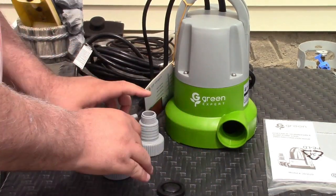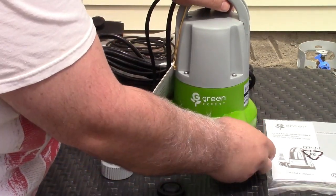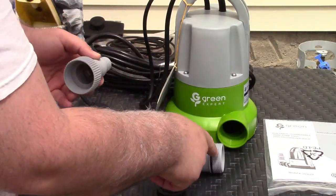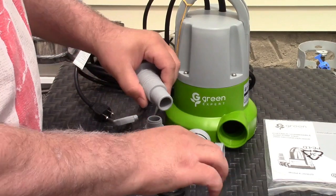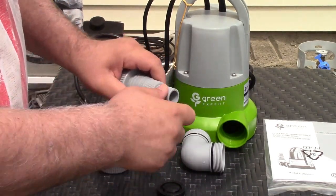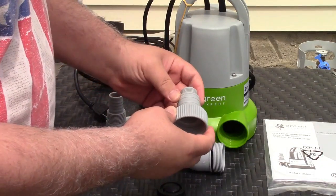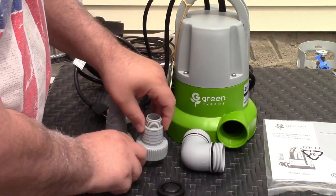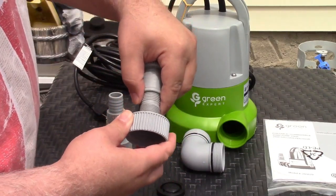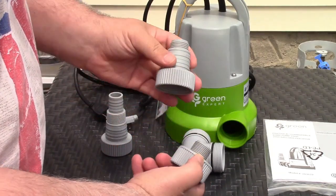There's a one and a half inch threaded output here, and your elbow piece screws into that. You would typically use one of three fittings with it. This one converts from one and a half inch down to three-quarter inch — you can put a hose on there with a clamp. For one inch, you take a hacksaw and chop off that nipple piece and screw onto those threads. This one here is what most people will use: hose thread. And this one is pipe thread. Both are three-quarter inch — note the finer thread is pipe and the coarser thread is for your garden hose.